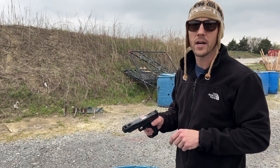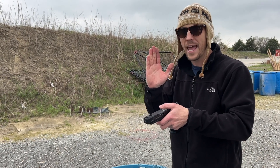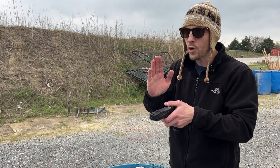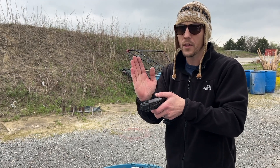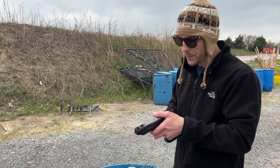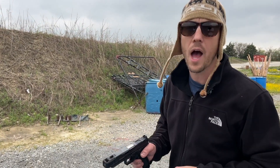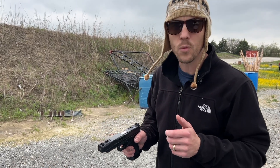It helps you track the sight. However, putting the sight on the compensator is kind of a technical business, because if that compensator doesn't stay clocked to the barrel — meaning dead straight all the time — then you are going to have your windage shift in your group. If the comp is moving a little bit, then your front sight is too. So that created a technical problem that we had to overcome with the locking key inside the barrel.